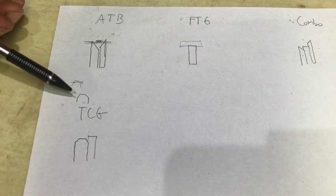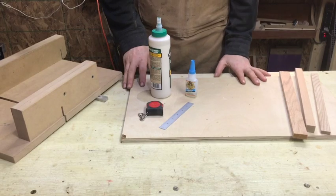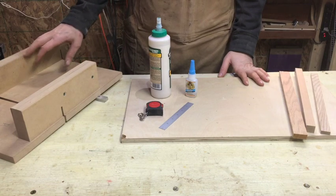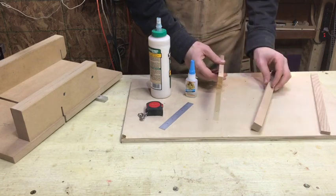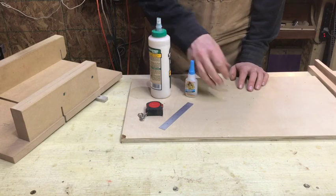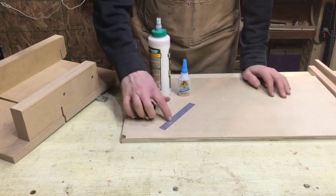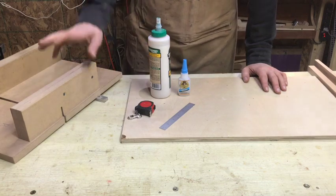I really wouldn't suggest the triple chip grind — it leaves an awkward shape. Now these are the materials we need to make this jig. Because this is a jig designed for a crosscut sled, I'll assume you have one. We'll need a piece of hardwood for our spacer — preferably something hard like red oak, maple, ash, white oak, or hickory. I wouldn't use cherry or walnut as they'll wear down quicker. We'll also need a piece of half-inch plywood, a tape measure, some glue, and a ruler. You can make this in 10-15 minutes.